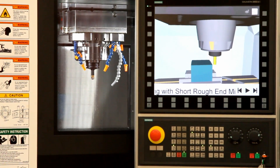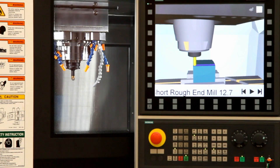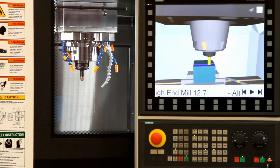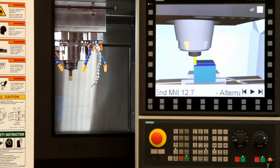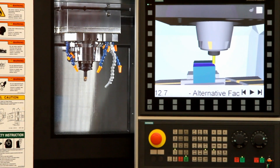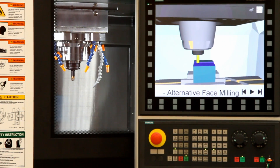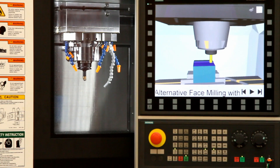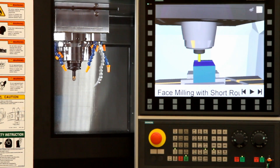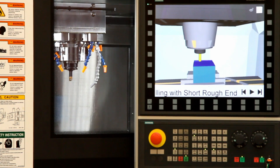On July 12th, 2017, we will demonstrate integrated machining and measurement using digital twins. This is some early footage of the digital twin in action at the DMDII. Here the machine is air milling, but we use the twin to show what would be machined. This is taking live feedback from the Siemens control every 4 milliseconds and showing the output from the twin server using a web browser on the HMI.